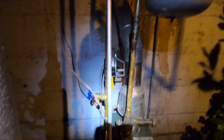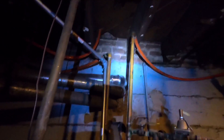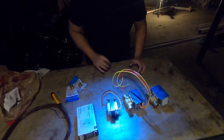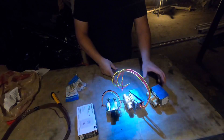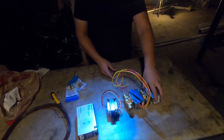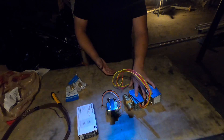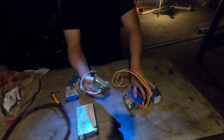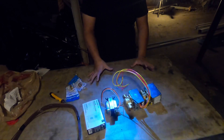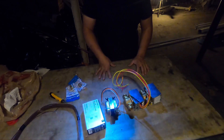Today I'm going to put a zone valve in this system to separate it. I have three bedrooms, so I'm going to separate all these bedrooms from the living room. This is the stuff you need: a zone valve — I got it from housesupply.com, it's about 30 to 35 dollars cheaper than Home Depot. You also need a transformer, thermostat, and wire. I'm going to show you step by step what to do and how to do it.